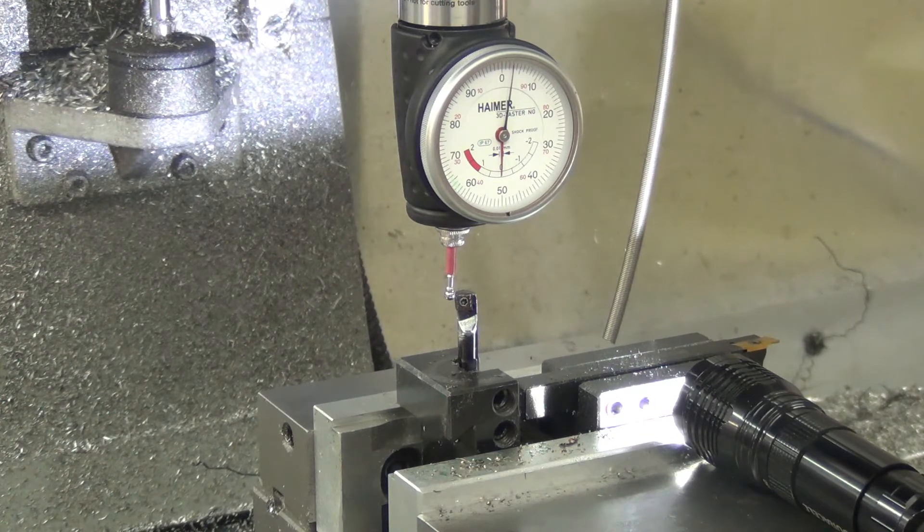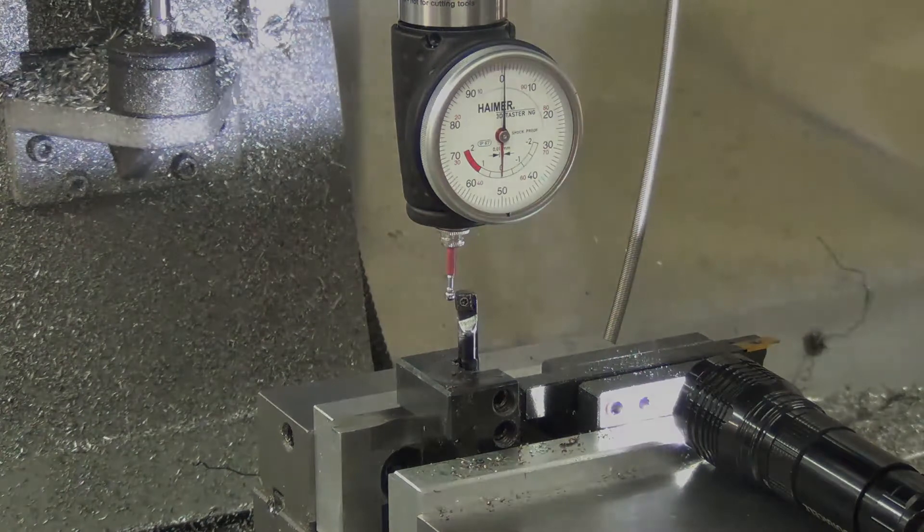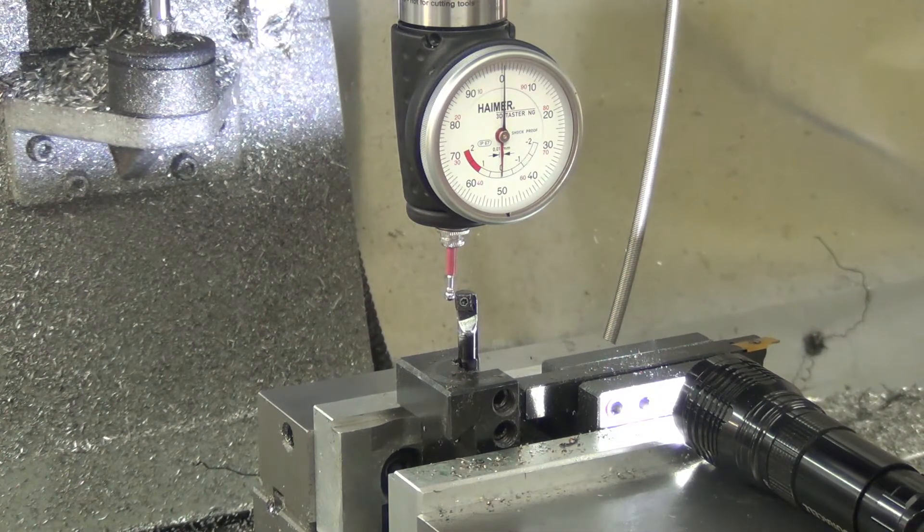There's about 0.01 millimeters difference. That looks like it's pretty much stopped, and then it'll go back down. We're going to call that good. Now I'm going to move the X back over and re-zero it right there. That says I'm 2.6 thousandths difference — so I was saying it was half thousandths but it's actually two thousandths difference.